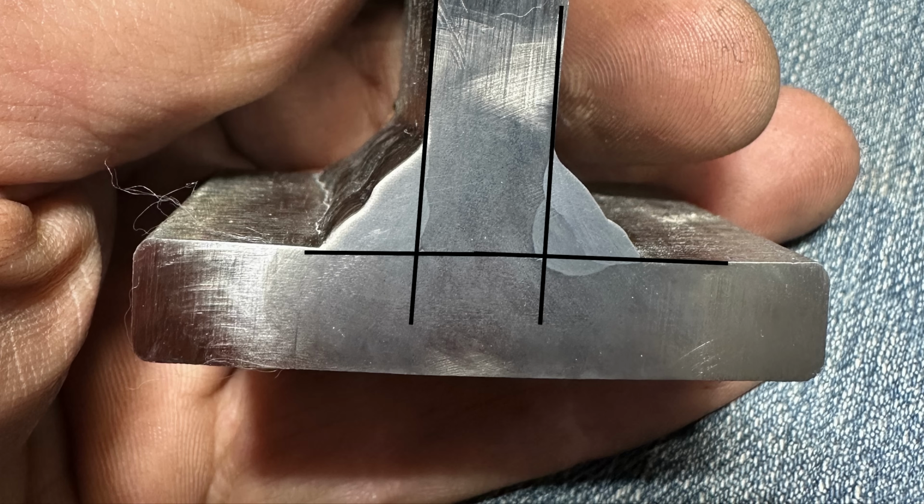You guys also have to remember that a fillet weld like this, due to the 90-degree angle, forces a lot of weld material to build up because it can't flow out or spread out as much as like a beveled pipe where you're running a shallower angle. And that's one of the reasons why, on pipes, when you do open root beveled butt welds, the bevels, both of them combined, are more open than this. That gives the slag and the flux ability to flow out, and it also reduces the thickness of the weld material. When you look at the root all the way to the throat of the weld, like the surface, that's pretty thick, and when you're trying to weld through that much molten material and have that arc heat up that root, you're just not going to get a whole lot of root fusion doing that.